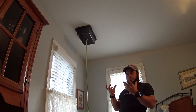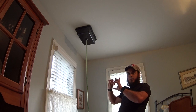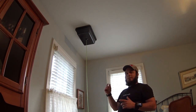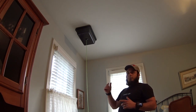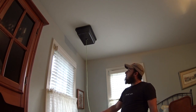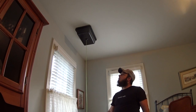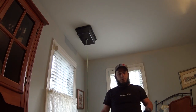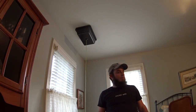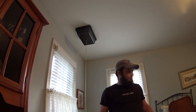If you were to plug the boot with a piece of foam rubber, like a 4x10 or 4x12 insert that would plug the boot, you wouldn't be testing the leakage of the boot frame to the sheetrock. So this is something that I'm really glad to have my hands on when it comes to ceiling mounted duct testing. I'm going to go through and get all the other ones, and we'll meet you back at the return.